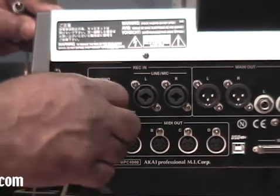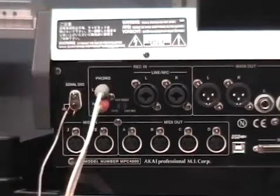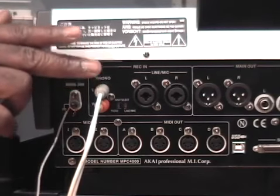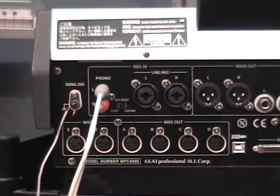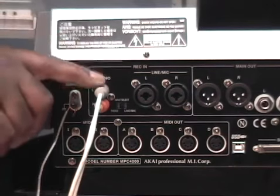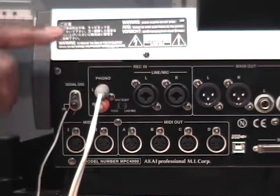These are your RCA inputs right here. Another one, right there. You gotta make sure you only put turntables in here. The reason why is they've got some sort of phono equalizer, which is applied to compensate for the frequency response of the signal that comes in the input here at these jacks. So these jacks are only good for phonos only. Put your turntables in, and that's it.